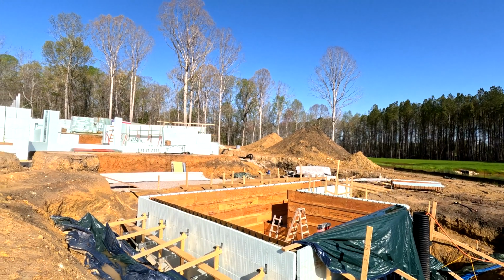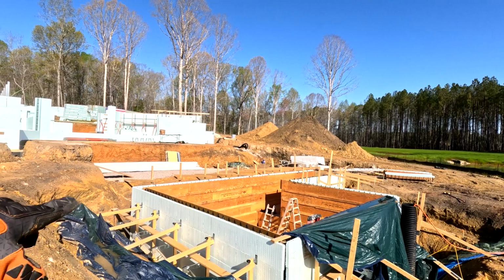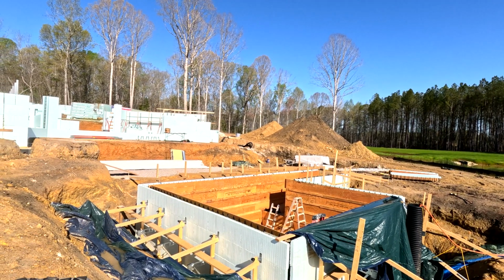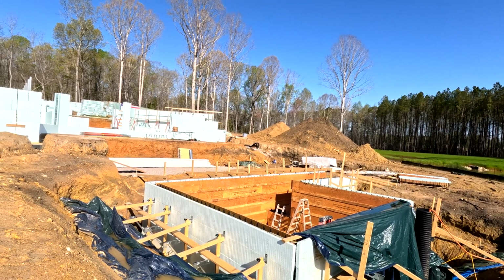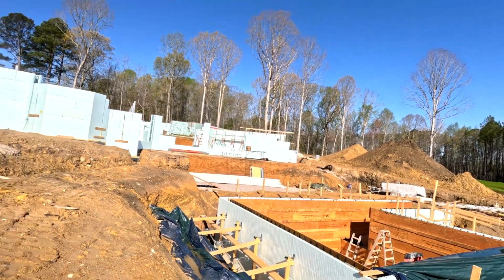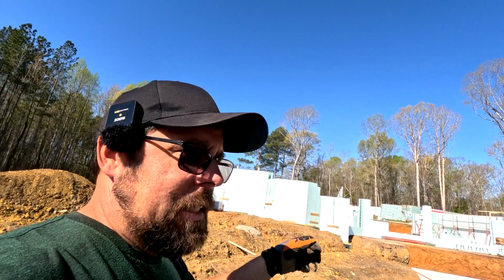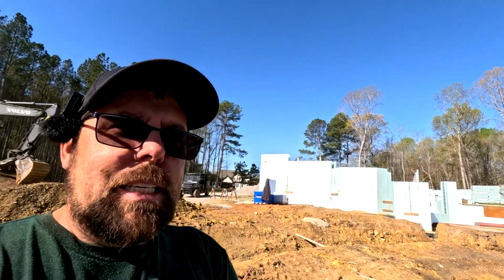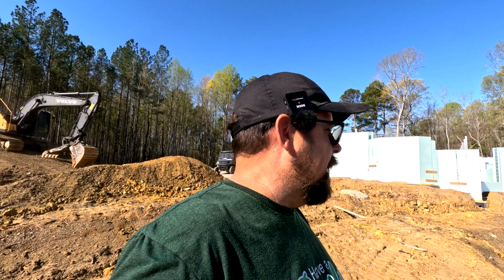So we'll get all those in, and then Aaron's on the way. Tomorrow we'll do the drains in the bottom, the foam, and the flat work bar for down there. So we're ready. Nice thing is the pool is 20 by 20 in the bottom, and the bar is 20 feet long. So it's just a matter of laying it in there with the correct spacing, and then he's bringing his automatic rebar tier. So we're definitely going to make use of that. We'll see how it goes.